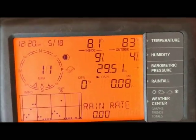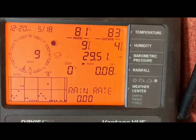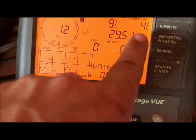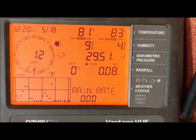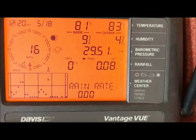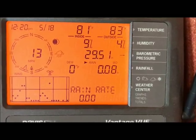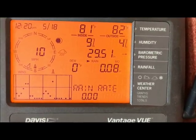As we're running our test, I'm taking a look at our weather station. The temperature inside shows 81 degrees, which agrees with our temperature gauges. And then right here is the humidity — 4% outside, 9% inside. That's one of the reasons why that unit is working so well — because the humidity is so low. So just so you know, if you use it in like where we used to live in Illinois, where the humidity is like 50-60% and it's miserable, it's not going to work. But if you're in a drier climate where the humidity level is low, it's going to work great.